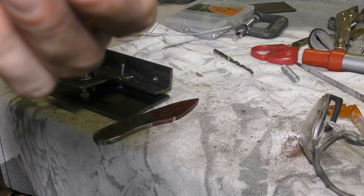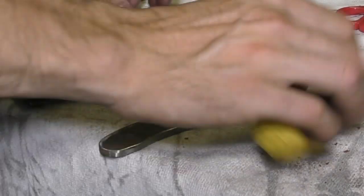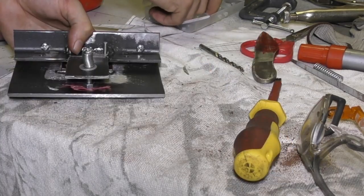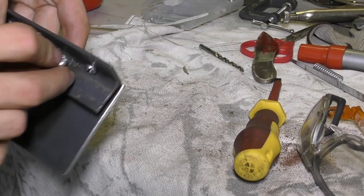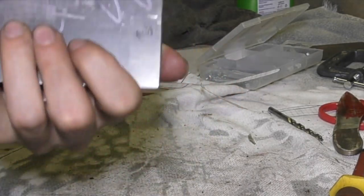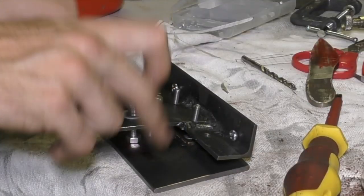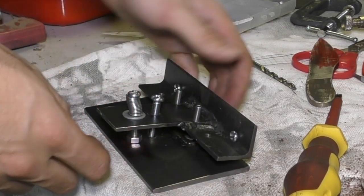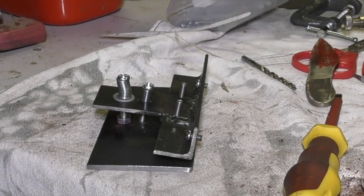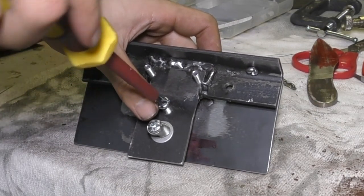So we've made a few minor adjustments, and to help demonstrate them I'll use this small piece of 5mm D2 to see whether or not this is going to work as intended. We'll start at the front. We have these two M5 screws that are basically just shortened down using the grinder — they're quite small screws — and they just pass through the front of the angle iron. Next, we have the two holes where the original angle adjustment M6 screws were. I've actually taken those both out, because they were so in line with the hinge that the pivot point was actually tearing away. You'll notice that now I've got three rivets on there, and they're significantly larger than the last ones.